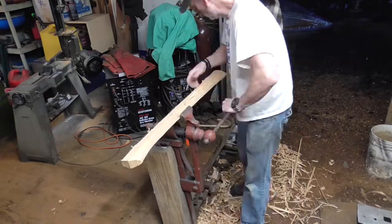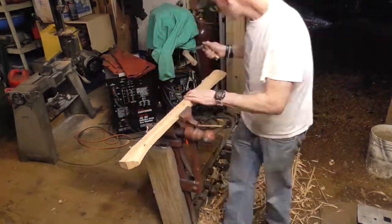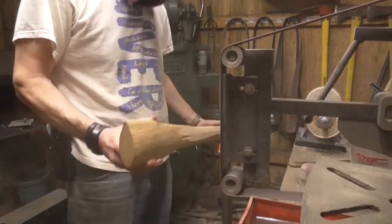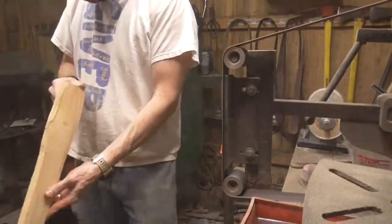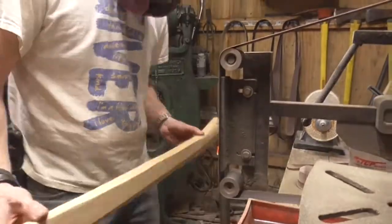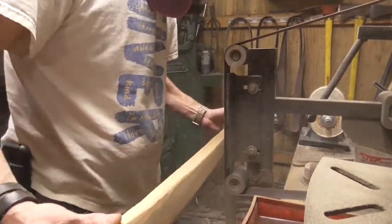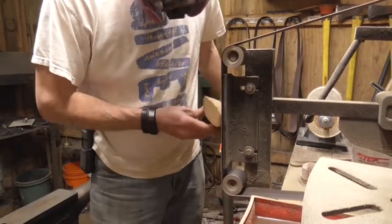The reality is I can only work that end piece because of the way the grain is working, so I decided it might not be worth it — let's just go ahead and move over to the sander. Here we're trying to get the sides parallel first to the pattern on the end, because nothing matters if the blade is not pointed in the same direction as the handle — then you've totally screwed up. So that's all I'm trying to do here: establish the flat sides of the handle, and also start doing some bulk removal of the domed side. You'll see me spending a lot of time in the center on one side and less on the other.